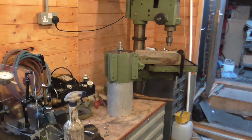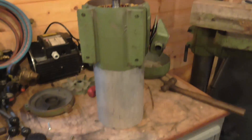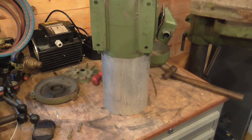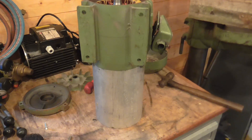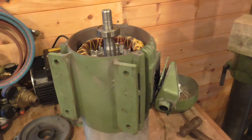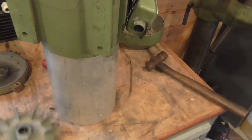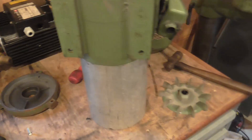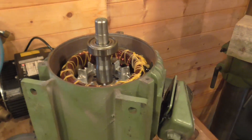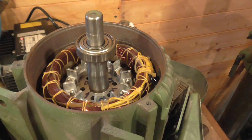As you can see, I got the motor out with no hassle at all, and I've left the pulley on it. I had this bit of heavy wall aluminium tubing on the shelf that it stands in nicely. I've taken the fan shroud off, and the fan and the end bell. There's an NTN bearing in there, which is a reasonable brand, and what I'm looking for in here is to reconfigure the star point.